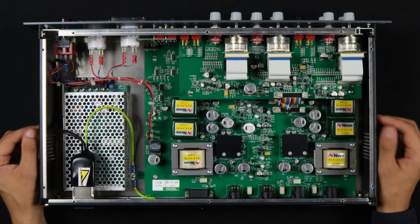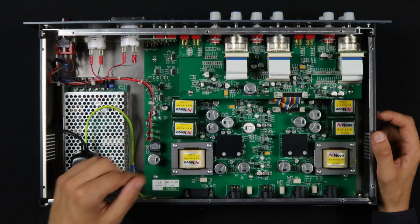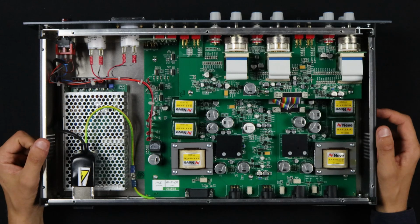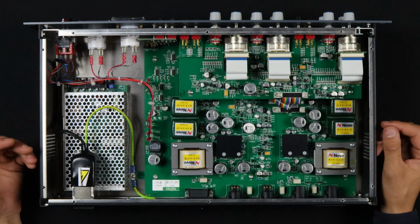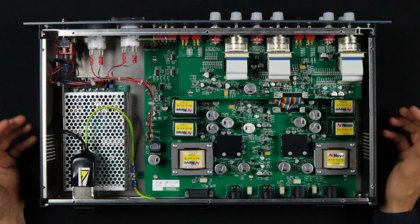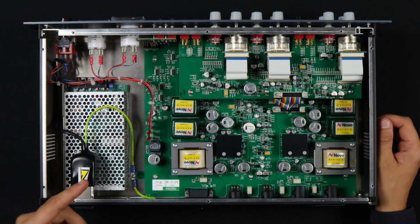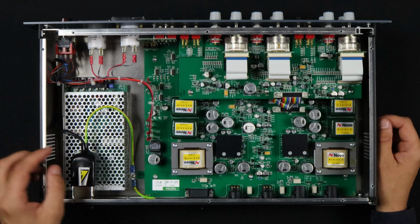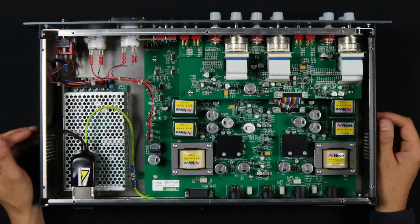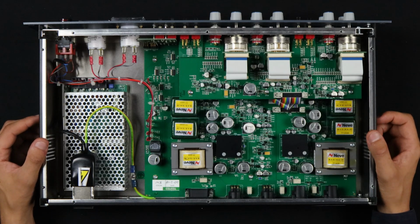That's because in the very beginning, in the late 60s, Neve used Marinair. Marinair made all the transformers for Neve. And Marinair very quickly went away. And then St. Ives began making the transformers. And since then, the transformers have never really quite been what they were with Marinair. So even within the same console, the same old vintage Neves, you will find Marinair and St. Ives commingling. And eventually Carnhill either turned into or bought St. Ives, but they were manufactured under the St. Ives name well into the 90s and revised numerous times. And it was just something that Neve themselves were not super picky about. They were not against mixing various revisions in the same board or letting the transformer company revise it.